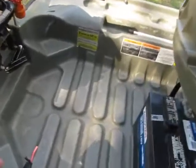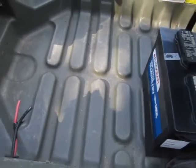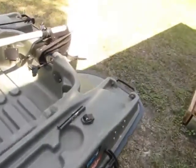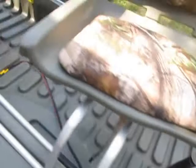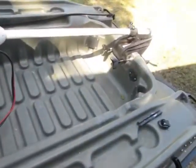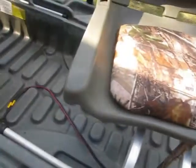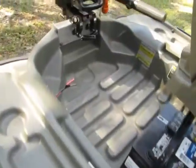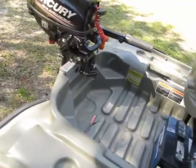The boat was pre-wired for the trolling motor to hook to the battery in the back, but personally I don't like plug-ins — they always seem to be a weak point in the battery connection. So I'm just going to hardwire it. That wire may get in the way at some point, but I do have a floor mat — like a yoga mat — that I purchased for it. That can lay in there and cover up the wire, so I don't think it'll be a problem.